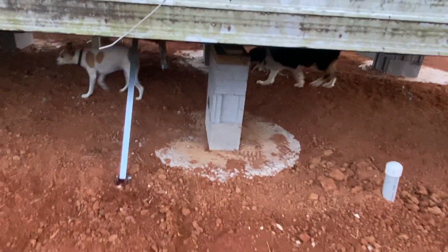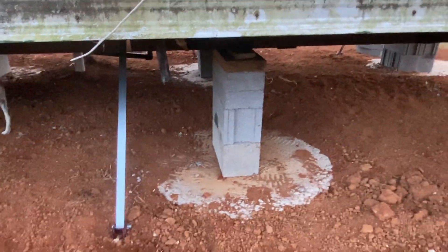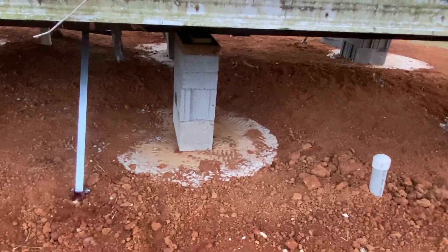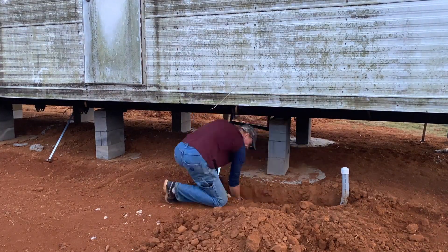What I'm going to attempt to fix is that the electrical comes out of the trailer right here, which is about three feet off of where I put the electrical conduit. In the interest of doing a job right, I'm going to dig down and bring the sweep up closer. The sun is way behind the ridge, about setting now. So I'm going to take the slow trip home on the spare tire, but I've made a little bit of progress here.